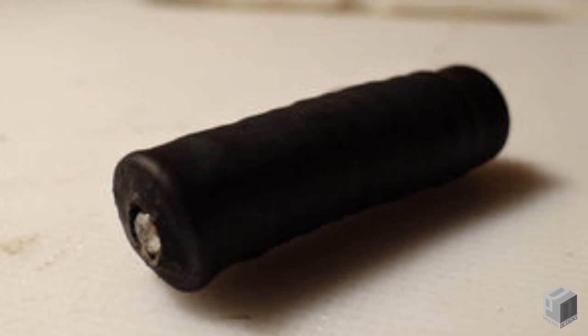If you added additional washers, this side will require quite a bit more solder. Repeat the process until full and top with a large bead of solder to signify the positive side. More or less solder can be added at this point to exactly match the correct length. Now you're done. It's time to test it. Your battery is now complete.